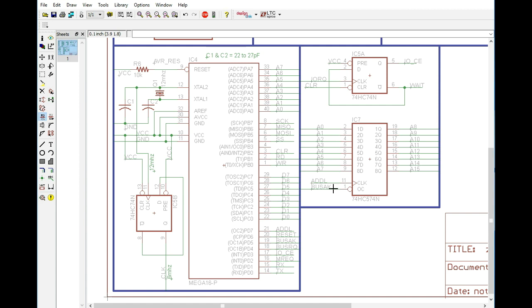This is going to be very similar to that. We're going to write to the AVR at a particular port and a particular value, and it's going to in turn release control of the bus, and then enter a DMA cycle. It's going to store that value back into memory at a particular memory address, and then give control of the bus back to the Z80, which can then access that memory location, read that data, and determine what it needs to do from there. So once we've modified the memory and acknowledged the bus and gone through that whole DMA write portion, at that point it's the end of that cycle.